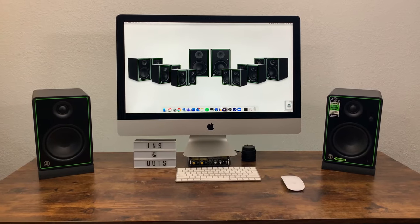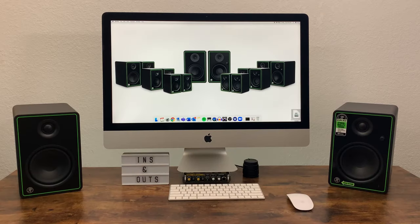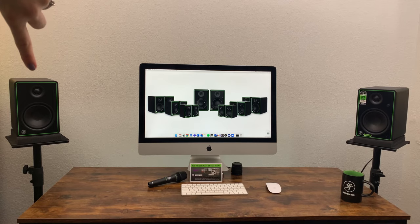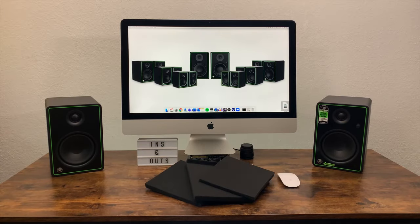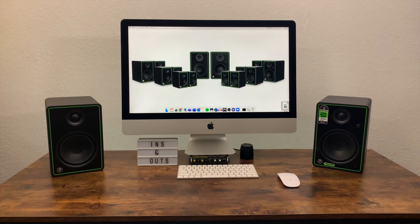Next, let's talk about position. The way your monitors sound can depend on the size and shape of your room and the position of your monitors. The center of a wall provides a well-balanced listening position. Feel free to incorporate monitor stands if you have to. We also recommend acoustic isolation pads. Without pads, your speakers couple to the surface you place them on, which can result in bass buildup that muddies and masks highs and mids.